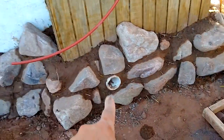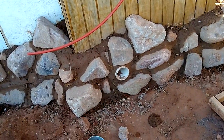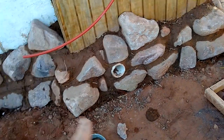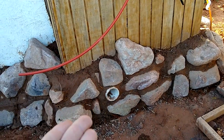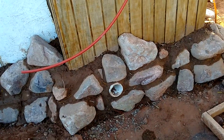One thing I did here which was a good catch — I'm putting a few vent holes underneath here. I was thinking if this gets wet, it is a pump house, if water gets under there that's a place for mold. So I'm putting three four-inch vent pipes in. I'll put some screening material over that to keep bugs and mice and stuff out.